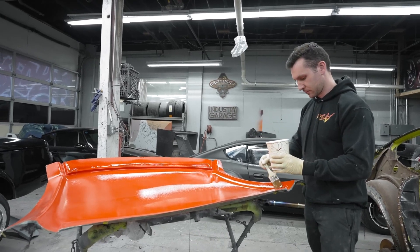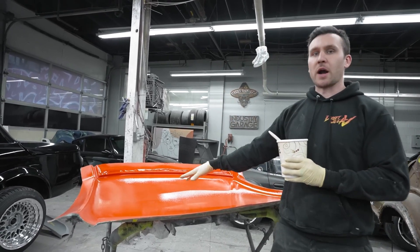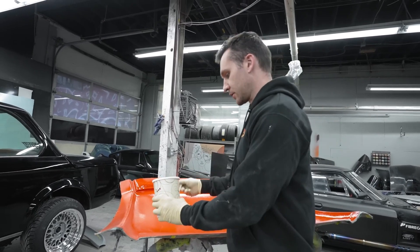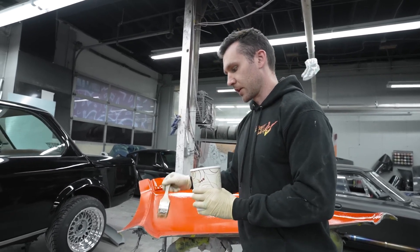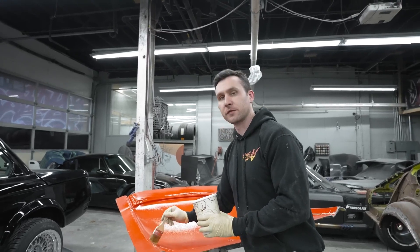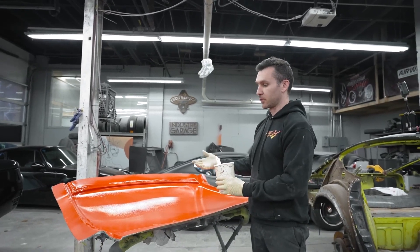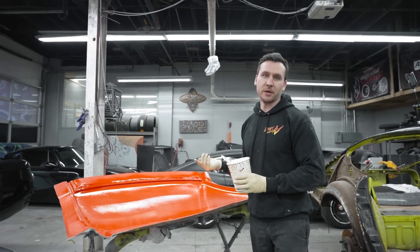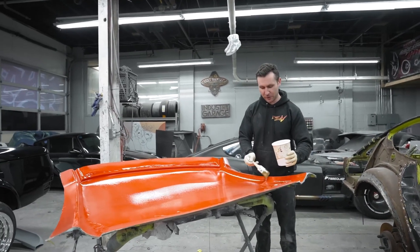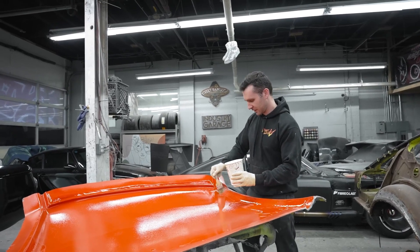I'm going to wet this out first. We already have the PVA, wax, and clear gel coat down — I did that yesterday. I like letting the gel coat sit longer. You can technically get into making your part an hour after spraying, but it's extra sticky and takes a long time to fully cure. I like letting it sit longer so it won't grab your carbon. But with this new carbon, even if it grabs it, it's not going to mess up the weave — so it should be an even more fail-proof method.